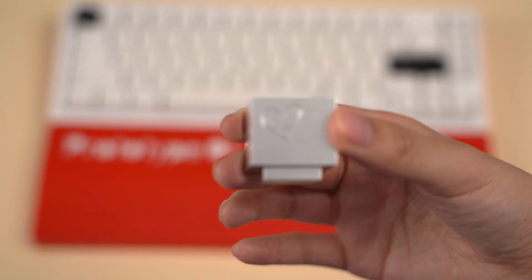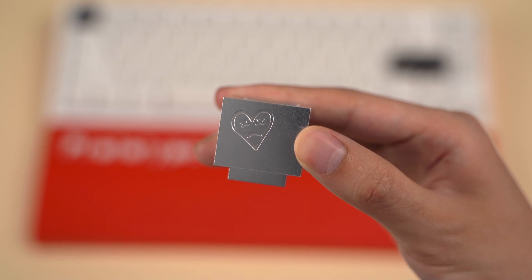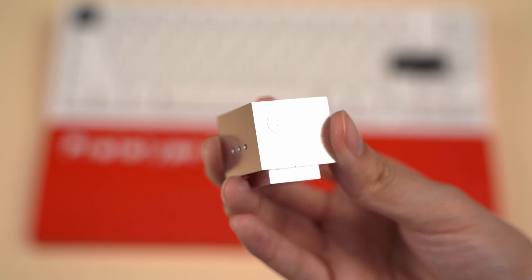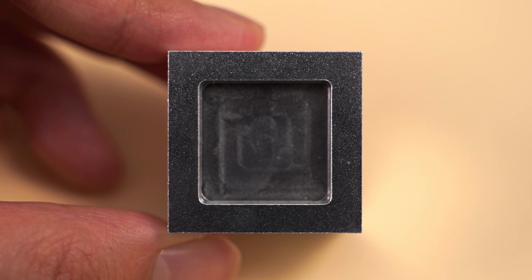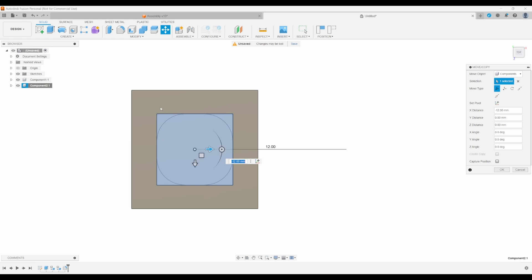Apart from the 3D printed keyboard, I had this additional cube CNC milled so I can test a few more things. Because 3D printing and CNC milling are different manufacturing processes, it's safe to assume that their capabilities are different. This cube has a few different tests on it: there's a hole at the top and an extrusion at the bottom so I can measure tolerances, an engraving to test the engraving depth, and three threaded screw holes on the side. One important thing I noticed was that the hole at the top has rounded corners even though I designed it with sharp ones — this is a big problem because the corners may interfere with the object I'm trying to insert. Because of this, I'm going to have to change the design of my letters to include rounded corners so they can fit into their designated cutouts perfectly.